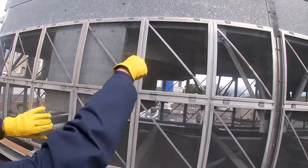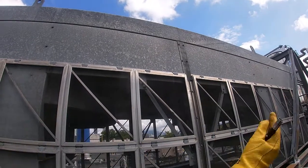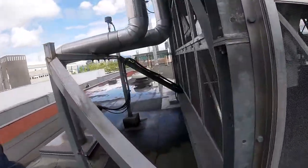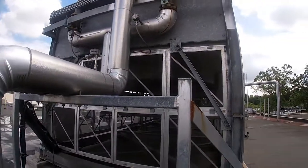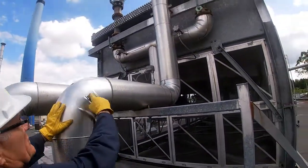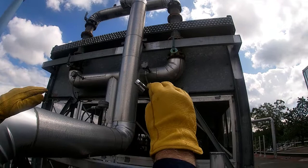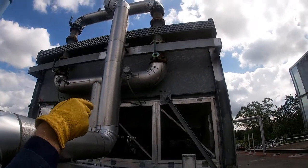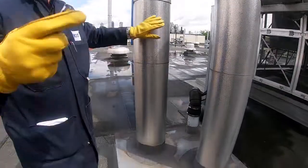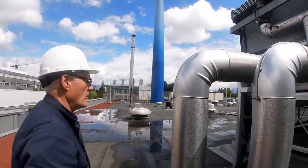The upper section above these fans — it's just a whole bunch of thin tubes that are being cooled. The coolant is coming up, goes along on this first line here up to the top, goes through a whole set of tubes to a header at the other end, and then returns on the lower ones. So inlet, outlet — that comes back, is combined, comes down through this line and goes back to the storage tank we saw a few moments ago. These fluid coolers are cooling the storage tank down.